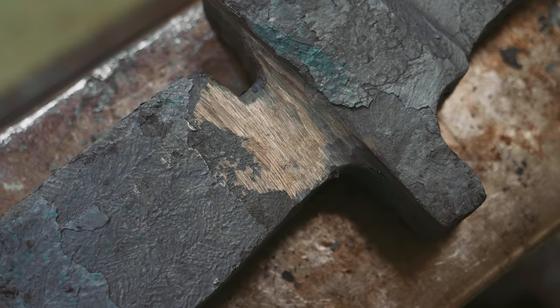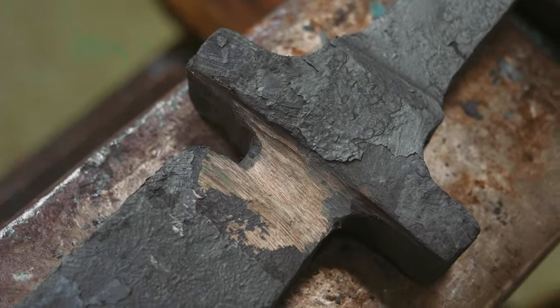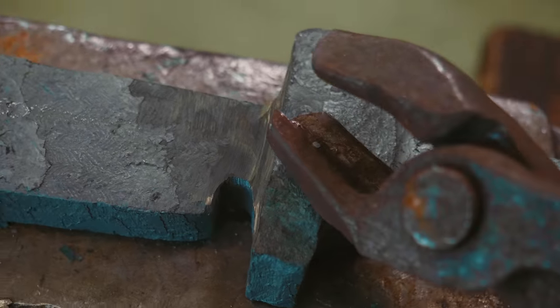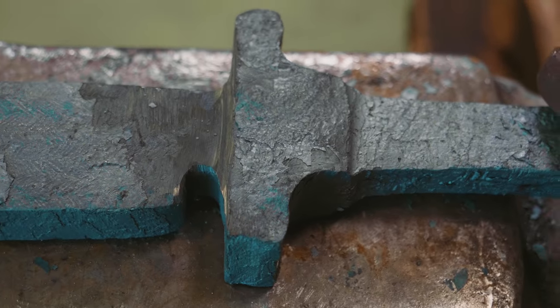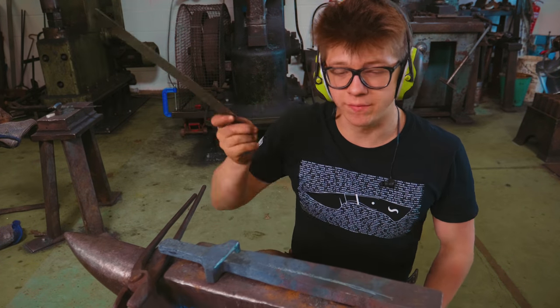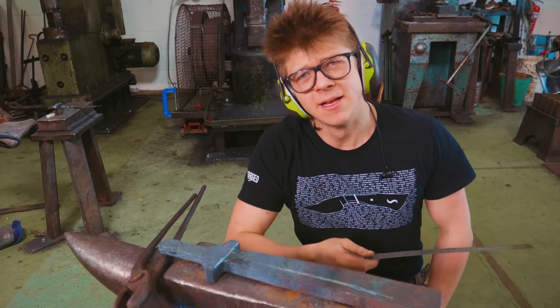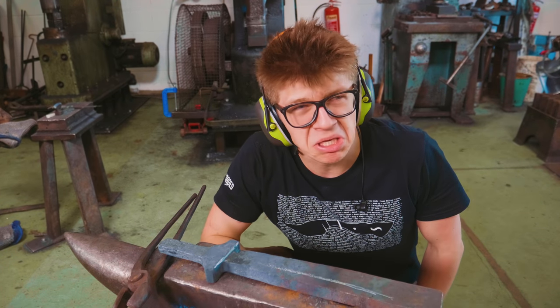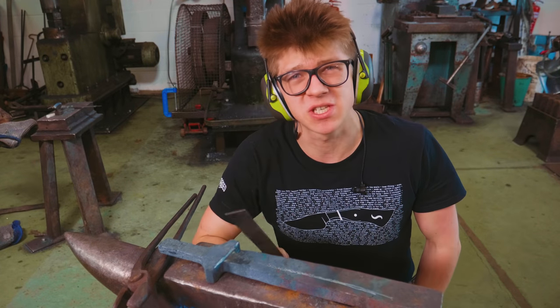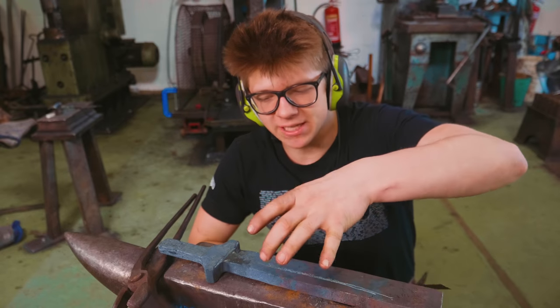Okay, so I actually just ran into the grinding room and cleaned up the shoulders a little bit with an angle grinder. And that there is the basis of the preform for the back half of the knife. So here's where we're at. We have an 11-inch piece of material for a 10-inch blade. The material is 5/8 of an inch thick, which means at the end we probably want to be about 5/16 of an inch, which is half of 5/8. 16 millimeters, 8 millimeters.